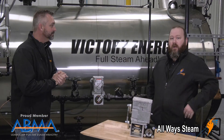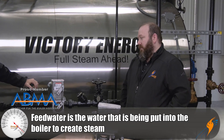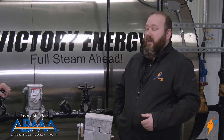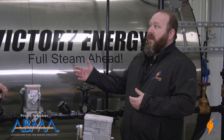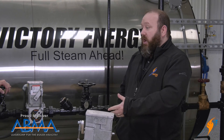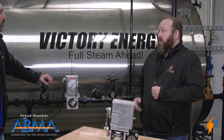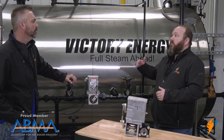Sure. Feed water, of course, is the water that is actually put into the boiler to create the steam. There are different ways of doing that. There are on/off pumps and on/off feed controls — basically you'll have a control that says, 'turn the pump on.' The pump will run until it satisfies whatever low water condition the boiler's calling for and shut off. Or you've got a modulating option that is a continuous run — your pumps basically run continuously, nonstop, and it is tuned with the steam rate of your boiler.